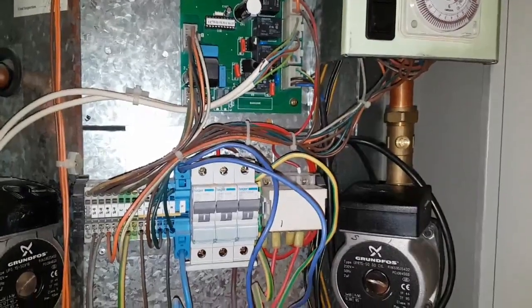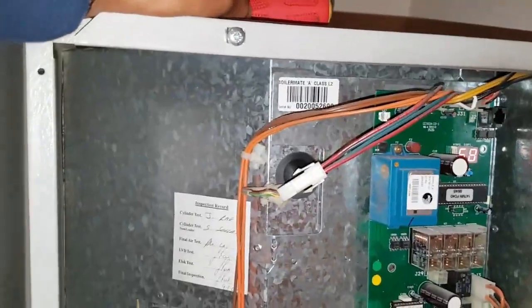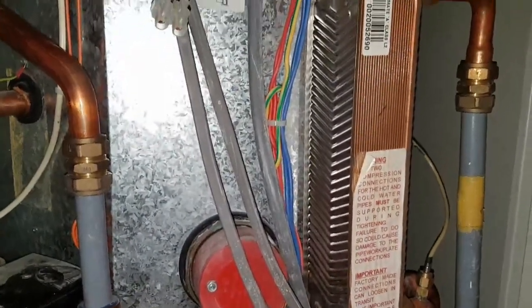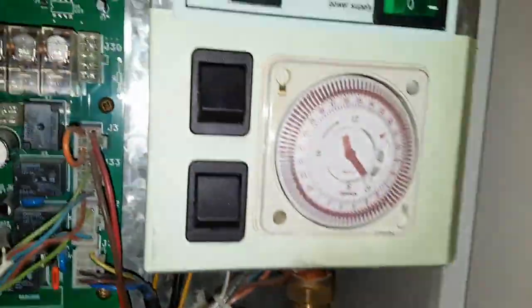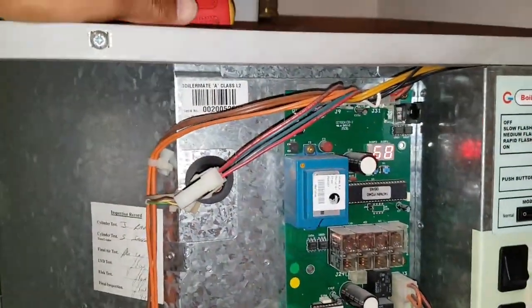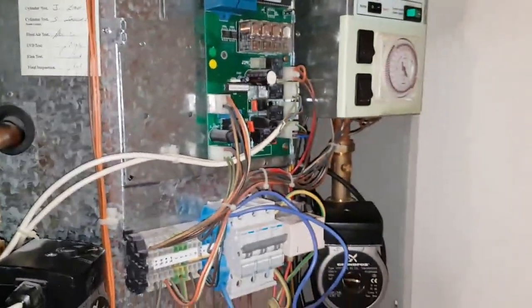That's why a lot of engineers run away - and this is why the master engineer can deal with this job, though it is challenging. It's also got an immersion heater as a backup to heat this thermal store if the gas boiler breaks down. You can switch it on using this mode switch here - flip that onto that switch and it'll energise the immersion heater. So that's a little tour of this Boiler Mate.